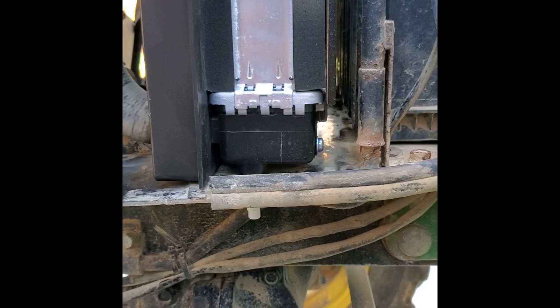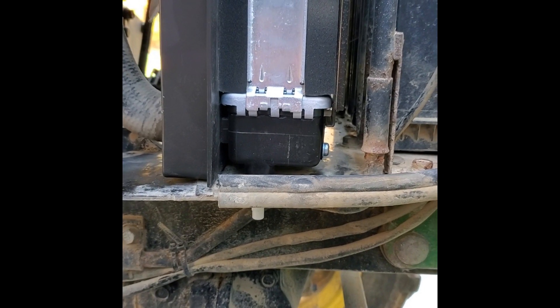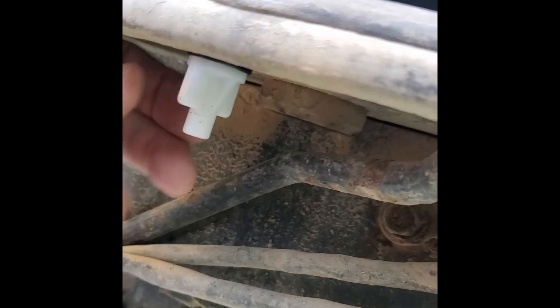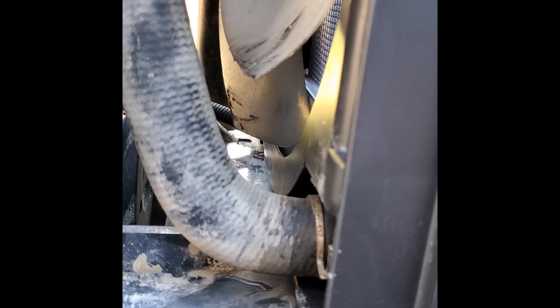If you have a leak in your radiator or coolant system and you're doing this replacement, there's a high probability that you may have an empty radiator already. But one of the first things you've got to do is drain out all the coolant from the system. What John Deere has on the bottom side is a little valve — you're just going to turn this counter-clockwise and loosen that up, and that's going to drain all the coolant out of the system. That'll get your radiator empty and some of these coolant lines empty as well, though when you start taking them apart you're going to have a little bit of drainage. Make sure you have a five-gallon bucket around — you're not supposed to let it get in the ground or go down the sewer, so keep it as clean as possible.